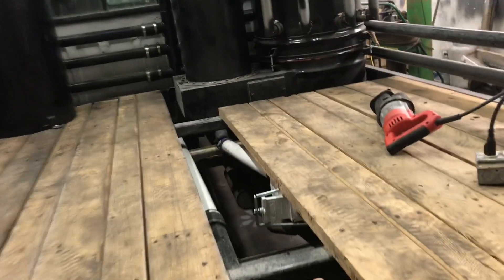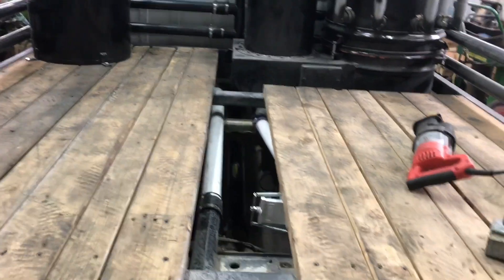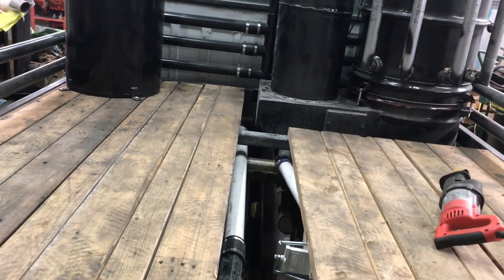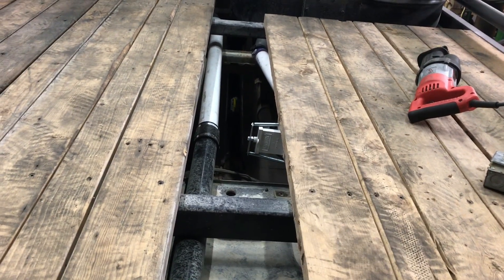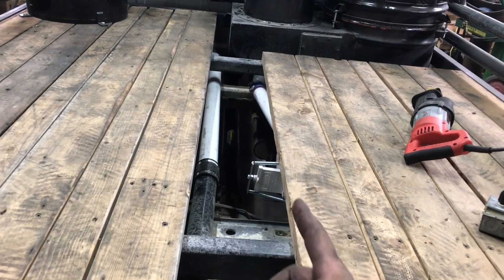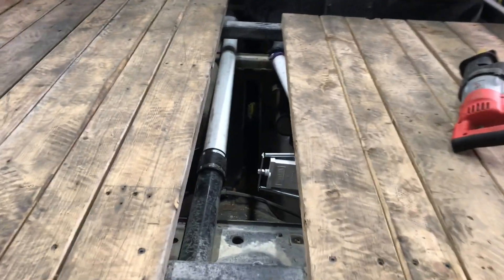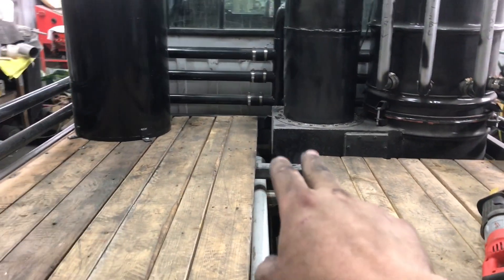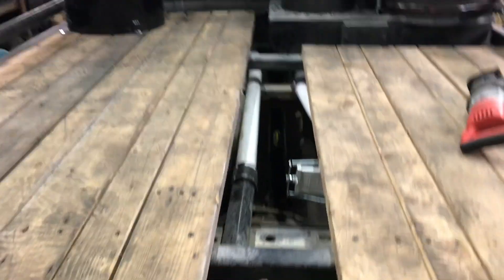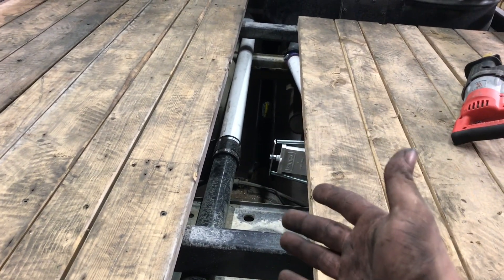Now I need to make the cable control to be able to activate that from in the cab. I'm sure a couple people are wondering — I put the bed on the truck, I put the gas fire in, why did I not board this over? Did I not have enough boards? I didn't buy any of these boards to start with — these are all scrap, and what's going to go here is scrap. I'm way too cheap to buy new lumber, especially at today's prices. But I left those boards off because I can get to every gas line, get to that valve, and do all my plumbing through there. I can access everything with these two boards off. I could have done it all from underneath, but why crawl under the truck when you can lay on your belly and do it right here?